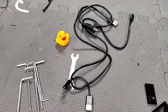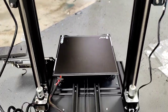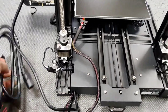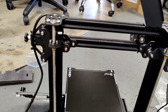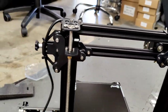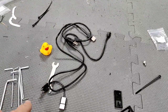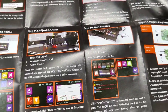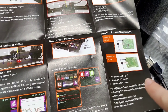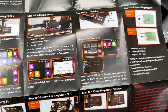Here's what's left after the install. That went together fairly quickly - definitely done in under 30 minutes for an experienced maker. If it's your first printer it might take an hour or more, but fairly simple. You just bolt that on, bolt those two on, plug everything in, assemble the extruder, plug that in, zip tie one cable, and you're good to go. These cables will go to the OctoPi setup. I've been through step 11. Now I prepare the Raspberry Pi. It tells me to go to Big Tree OctoPi. I'll probably load a custom setup and then mount the OctoPi to the back. I'll follow up with you shortly.